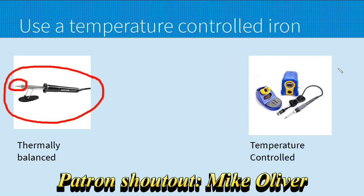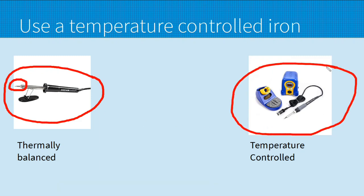By the time you've gone through all of that, you could get one of these irons for around twenty dollars, but you're better off to spend about a hundred bucks up front and pick up a temperature-controlled soldering iron. You can set the heat just a little bit hotter than what's needed to melt the solder but not so hot that you'll damage components. When working on ICs especially, you're better off to hit the joint with more heat for a shorter amount of time than less heat for a longer amount of time — that's called dwell time. You want your dwell time to be as small as possible.